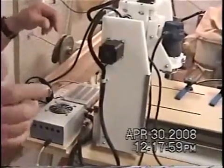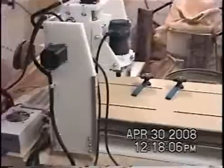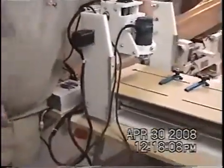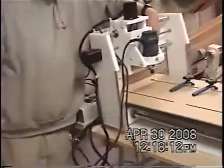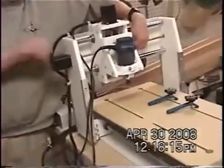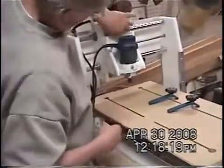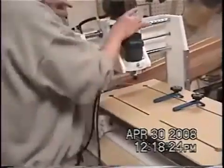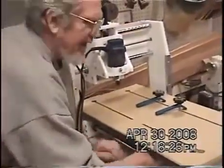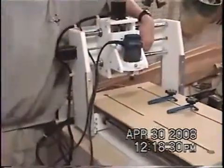What a CNC machine is, and there's one up here in the front: these are servo motors. They turn this shaft right here. They're geared on the thing, and they actually turn this so it goes whichever way it's going to go. Up and down is in here. If I can get a hold of it to turn it. I got it up too high. I can't get it in to turn. Then you got one that's down inside this thing. I can't get my hand in there, but it does the same thing as this.